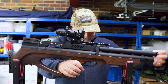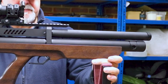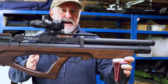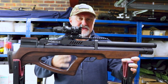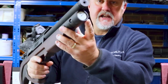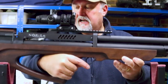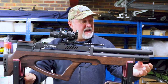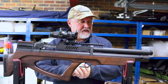The air cylinder down here is 340cc, and the rifle is actually regulated. Norica says the regulator pressure is set at 135 bar — I suspect that's for the higher power output versions. I don't know what it's set at for 12 foot pound rifles, but probably something lower than 135. On the end, you can see there is a gauge — it's actually a Wika gauge — which will tell you the overall fill pressure in the air cylinder, but there's no separate gauge for the regulator. Filling is achieved by turning this collar on the front to access the fill port.